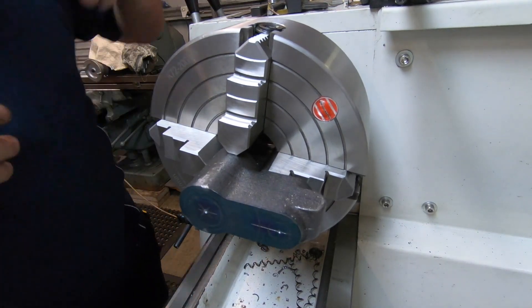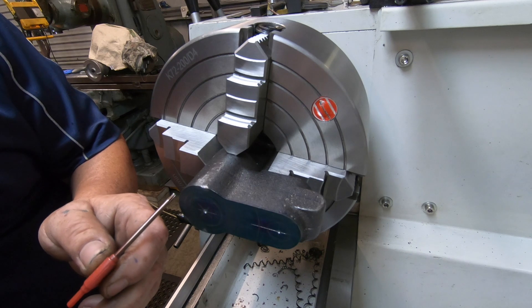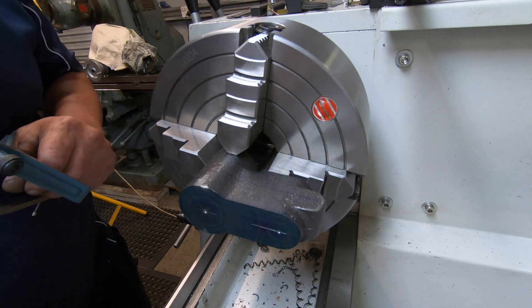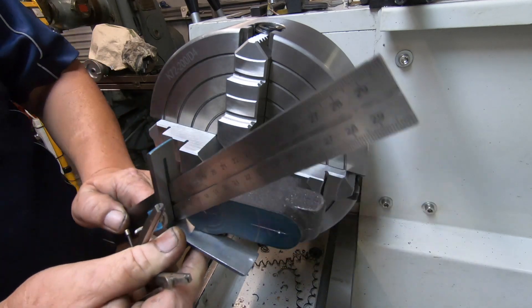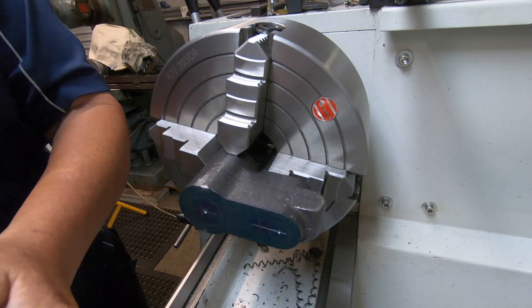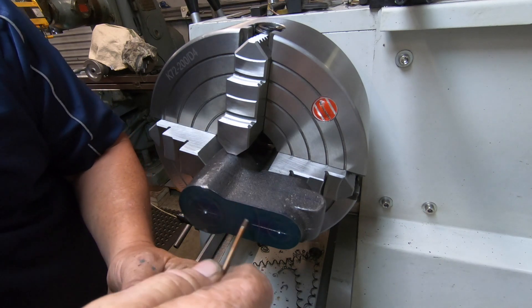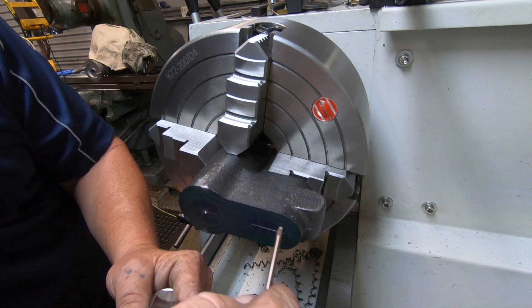Spot on — two inches. I've got no idea what I'm doing, but I suppose there's no right and wrong way of doing it. I found the centre of this boss by going across the centre, then I used an optical centre punch down the centre. Then I measured down two inches and used the optical punch again to mark the two-inch centre, which has to have a 5/8 hole there and an inch hole here.